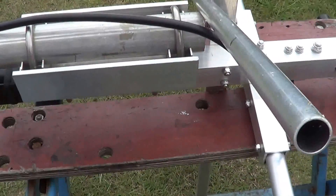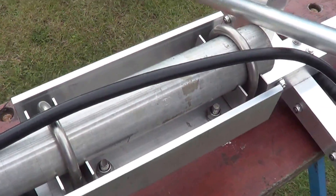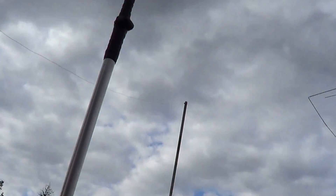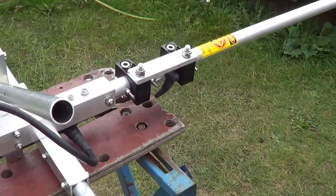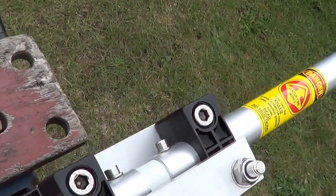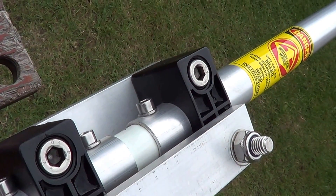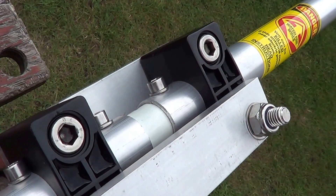As I showed you before, it's an extremely well-made aluminium channel for the mount. It's got four nine-foot radials for the ground plane, which is sturdily mounted. This is a new design. When Steve, who owns Vortex, came up here — you can see it's obviously got to have a link piece so the vertical radiator doesn't short out to the ground plane — so it's got a solid piece of fiberglass in there.